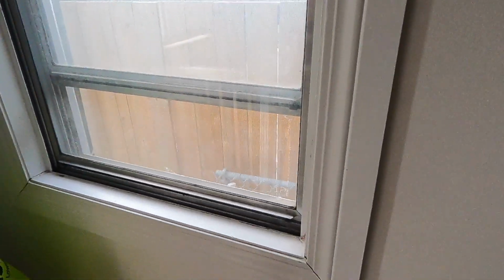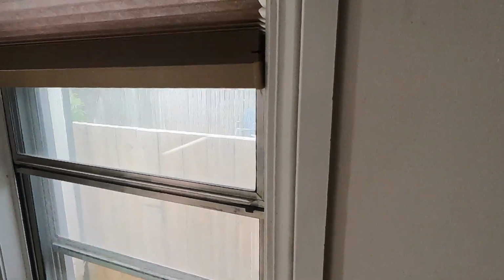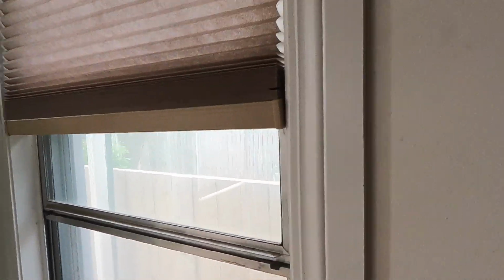Okay, we got all of the stuff swept up outside. Now, gotta take this trim off. So what we do is we take a knife and we cut along here, just in case there's any paint or caulking holding it on. Get that off there. I don't think we can reuse this trim because I think the new windows are a little bit different size. We'll see. If we can, we'll reuse it. Definitely put some new miters on there though.